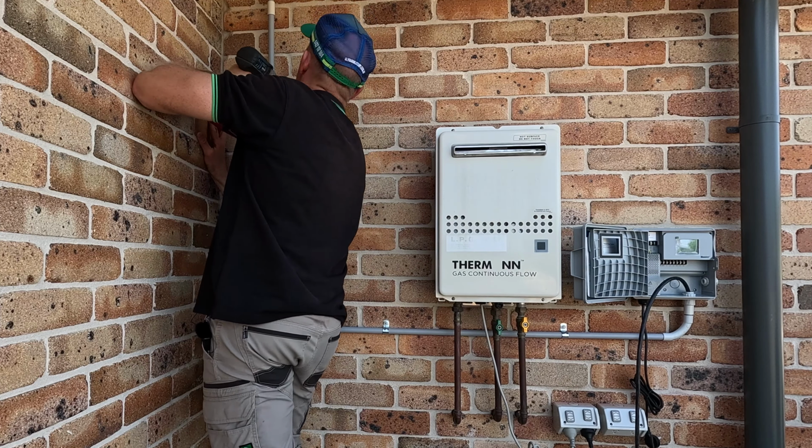This will go to zone 2 on the controller. This will go into zone 3, etc. So all of these, including this one here, one of all of these valve wires all join up together and they become the common. And the others become the zones included. So that's as complicated as that part gets, but I'll work through it with you slowly to give you a bit of an idea of exactly how that looks.